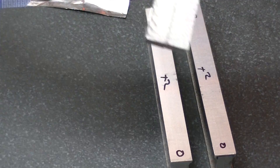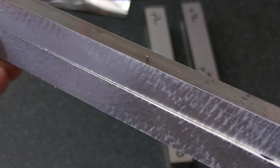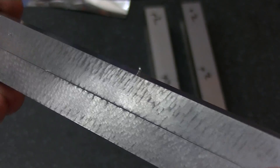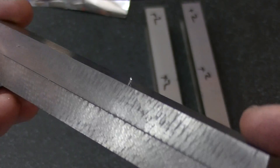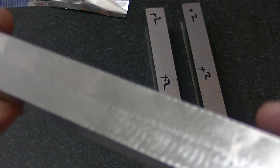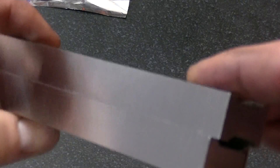So this is last year — the kind of surface finish I would be getting with my surface grinder. Not great. I mean it looks pretty, but it's kind of flat — not pretty. I haven't measured these out yet but they should be pretty good. That's the kind of surface finish I was getting before balancing the wheel properly. And I'll show you what I'm getting now with these parallels — to me, this is pretty amazing for a real budget Chinese surface grinder from Grizzly.